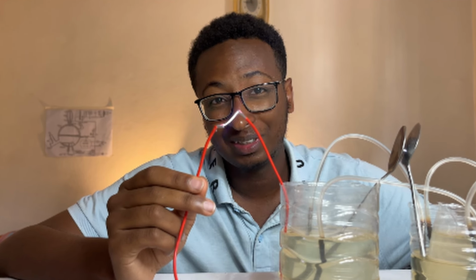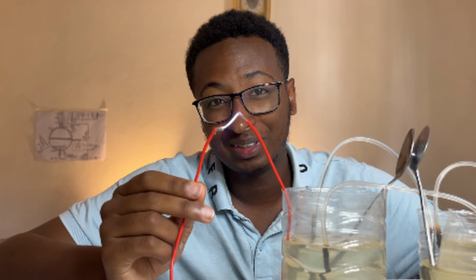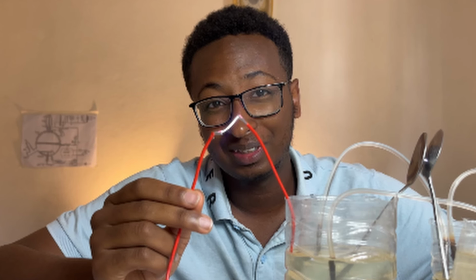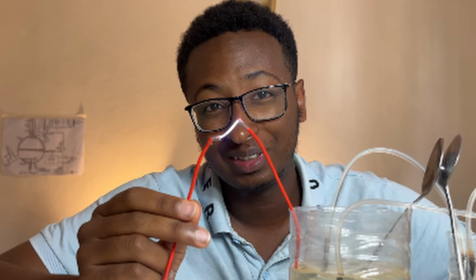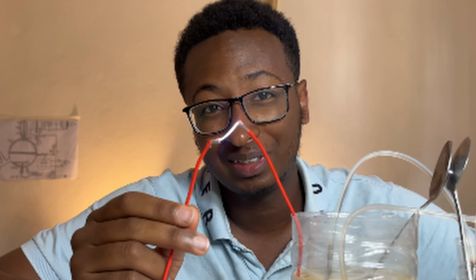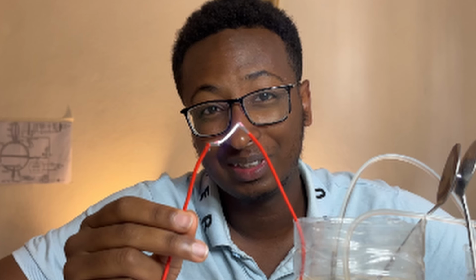That is huge. So yeah, the voltage is slightly higher than my original power supply. The original high voltage that I was supplying was in the tens of thousands, at least up to 60,000, I believe. But now, measuring it, the Marx generator just generated about a 2-inch spark, which is about 5 centimeters.